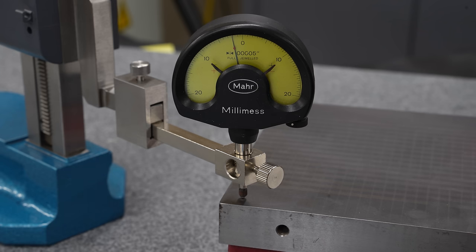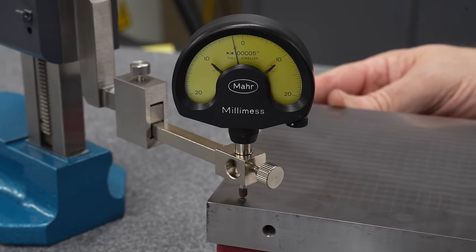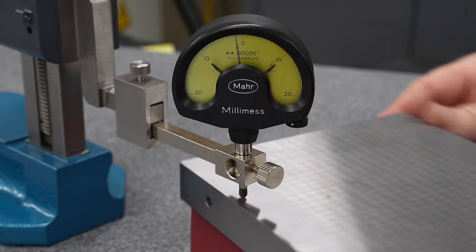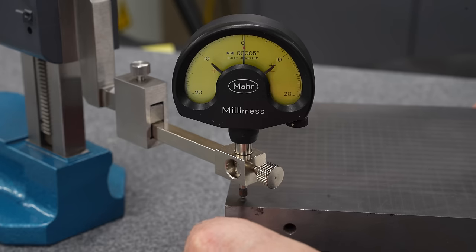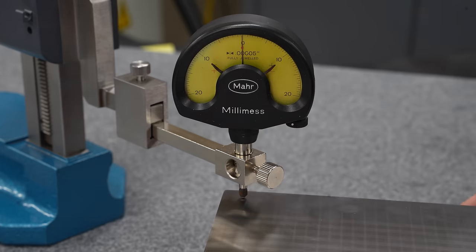And yeah, we're at 2/10 there. That's like the factory spec. Again, I was really hoping to be better than that. There's a little bit of motion here. It's just starting to dawn on me that that might actually be an issue. Back to this corner, we're pretty much back to zero, and back where we started, we're now showing just ever so slightly above zero.